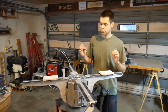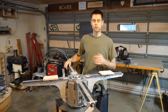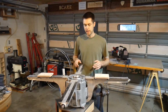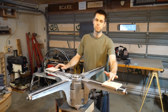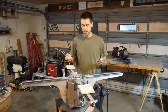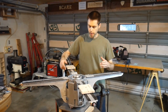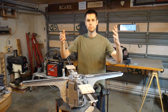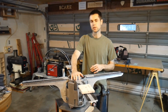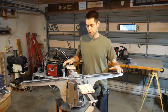Since we're on the hunt for a mechanism that comes in a pre-built assembly, I thought it'd be good, real quick, to review what it is that we're looking for in our mechanism. Most important thing, obviously, is that it has to go around. And with an expanding table, it obviously has to expand. If you don't have that, that's no good. And it has to go up and down by 2 different amounts. These intermediate ones, which are over there somewhere, go up by 1 whatever unit. In my case, it's about 1 inch. And then the star that's in the center has to go up by 2x that amount, or 2 inches.